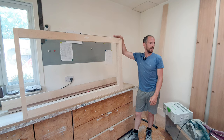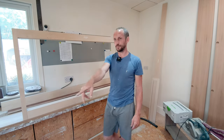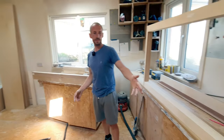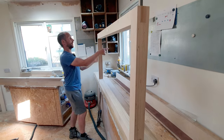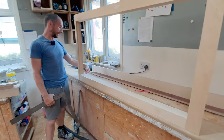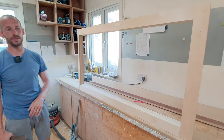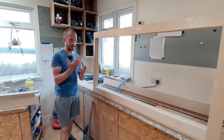Today we're going to be gluing. We're going to make ourselves a nice flat surface to glue these on because we don't want it to be twisted. We might pull out this little bench to the centre, find a nice slab of 18mm or 25mm MDF, make sure it's level and just work on that. Some sash clamps — I'm guessing four clamps — and our roofing square as we're doing it. Just let the glue do its work. We can go around and pin through the mortise and tenon if we really wanted to, but we're most likely just going to let the glue do its work. We get a nice resistance on the mortise and tenons, so once that glue goes in it's going to be solid and touching all the surfaces.